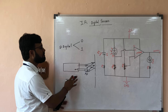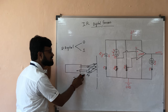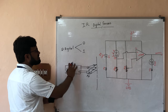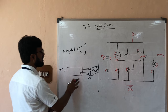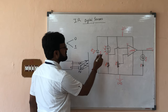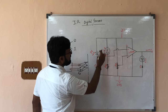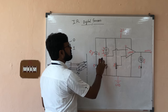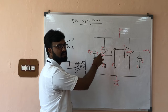Keep in mind that the most important part of our IR sensor is the photodiode, because this is where the sensor is accepting information. Internally, this data is processed and sent to a microcontroller. The IR rays reflected from the IR LED fall on the photodiode. The diode present here works in reverse bias — meaning if more light particles fall on this photodiode, more current is generated.